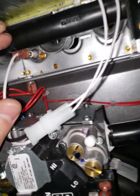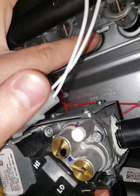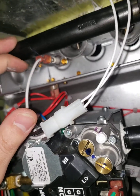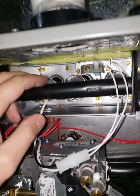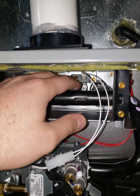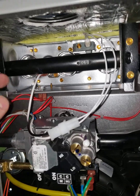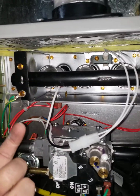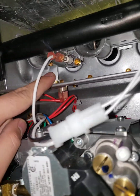The second thing that we're going to do — if you see these little brass screws here that I put into the Venturi tube, those are called mixing screws or mixer screws. So we have to take the whole Venturi tubes out. There's a little dimple underneath on the Venturi tube. We have to make a little hole with a drill bit that comes with the conversion kit, and then screw the screws in all the way so the head of the screw comes flush with the top of the Venturi tube.